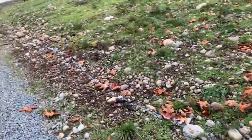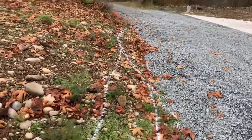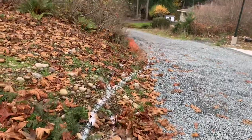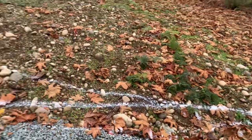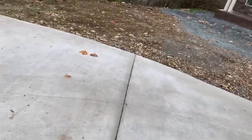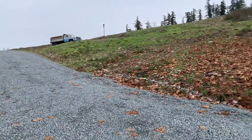This is the 18-foot mark right here. Originally I was thinking it was going to come in quite a ways, but it's not. What we want to do is when we get down here on this 18-foot mark, we want to widen out this little curve and make a wide radius, so that when this car is pulling out of its driveway it can make a wider turn. It's almost right at that 18 feet anyway, but you can see the tire marks — as they come out they try to make this curve and sometimes it's a little tight. We're going to make it 18 feet wide, which is going to help them out tremendously.